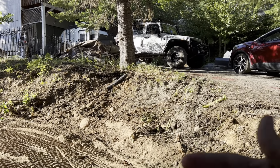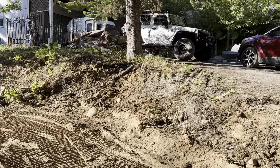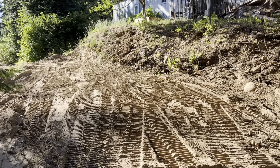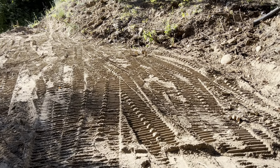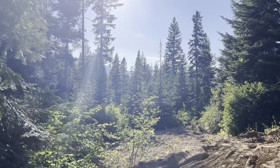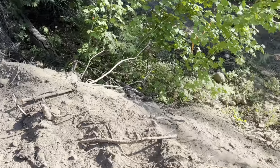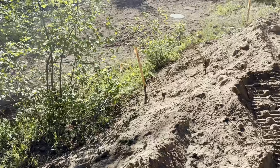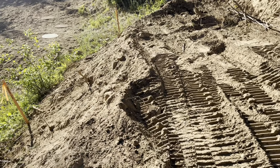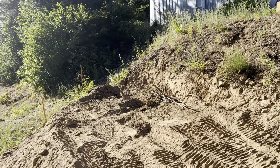And we'll put a retaining wall behind, along here we'll have a retaining wall, and then they can fill that in, bring that out. And then right in here we will have our fire pit with some nice seating around it. And the idea there is that that'll give you a nice view of the trees and the sun when it goes down at night, hang out around the fire. And then what we'll do along this bank, you can see the property line markers, we will put a retaining wall along the property line up 4 feet, bring that over and terrace it up to the edge up there. So we'll do terracing with 4 foot walls so that we don't need a permit.